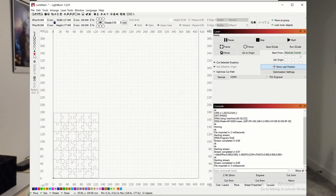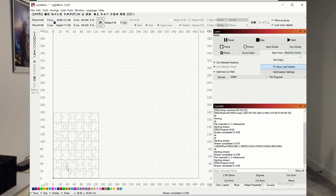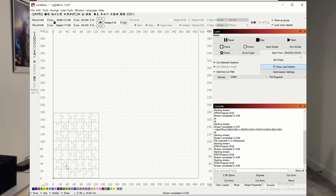Finally, this laser has GRBL support, which means it works with LightBurn and Laser GRBL. You'll want to make sure you have one of those for this tutorial. LightBurn has amazing layout capabilities so you can set up your puzzle. In the next part I'm going to show you how to set this up in LightBurn — I'll be talking over the video since the air pump was running. We'll line up the laser at the bottom left corner of the puzzle, do a framing, and then tell it to cut.